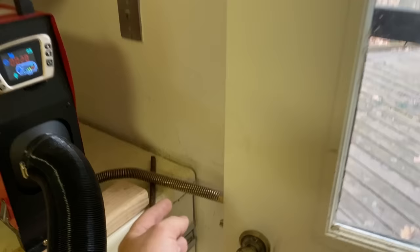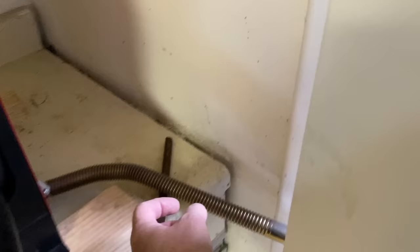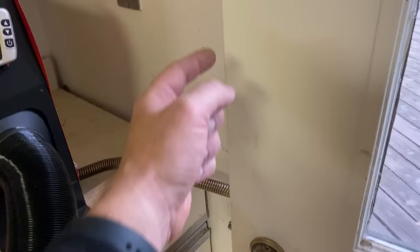This is about a 1-inch exhaust pipe, and it's fairly flexible. So you could drill maybe a 3-inch hole and then stick your 1-inch through there and put some kind of metal plate on it. You want to keep some space from combustibles, and then just vent the exhaust outside. So that'd be a nice way to go too. Then you keep all your controls in here and you can keep your diesel fuel or whatever, and just fill it up.